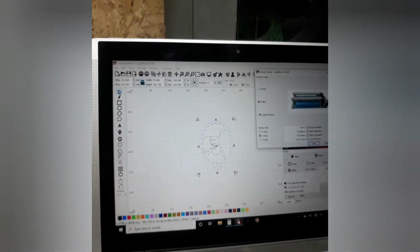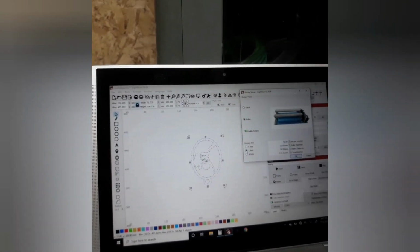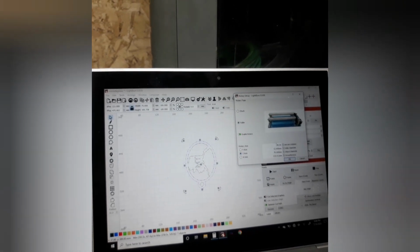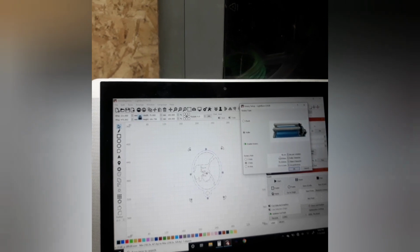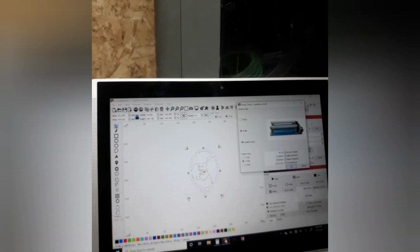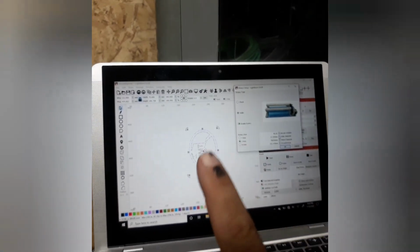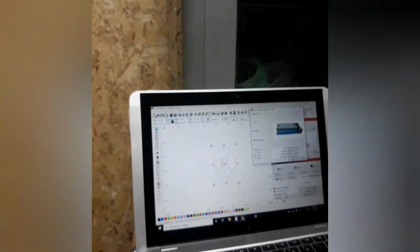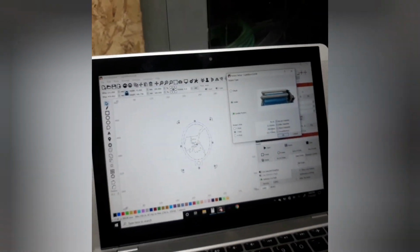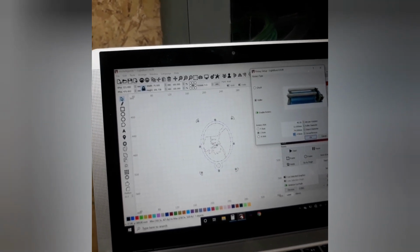Okay, so in Lightburn, we have roller, enable rotary. Mine's plugged into my z-axis. 40 millimeters per rotation. I have a 12 millimeter roller diameter. Now my object diameter, I just measured the top of the glass, measured the bottom of the glass where it's going to engrave, and then got an average figure. That figure is 74 millimeters. And then we have 232 as the circumference.